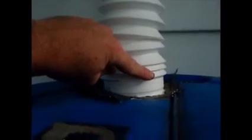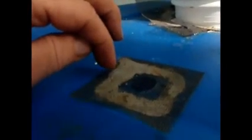You want to make sure you put your screens on. Like I say, the screens do 2 things. Coming out of your gutters like this, it will keep any leaves or sticks or anything from getting down into your barrel. That's why we've got the screen. You definitely want to screen in your air pressure release valve. Trust me, mosquitoes will get down in there, and you don't want all them mosquitoes laying all those little eggs, or whatever the heck mosquitoes do, that cause you to have a ton of them in your backyard while they're in the water.